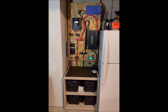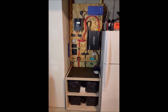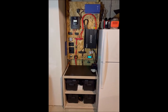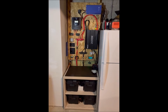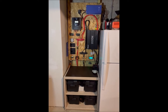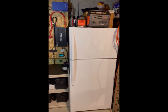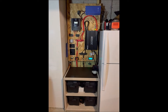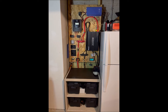Hello YouTube, today I want to show you my emergency power station that I've put together. It's a number of months in the making and it'll be used for power outages or long-term power outages. It's currently configured with four 100 amp hour batteries for a total of 400 amp hours and a 2000 watt inverter. It's only connected to this medium-size refrigerator at the moment, but it's doing a great job running that, and there's a lot more capacity — I could be running a lot more things.